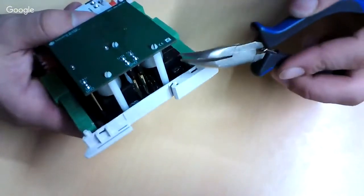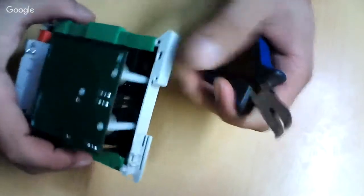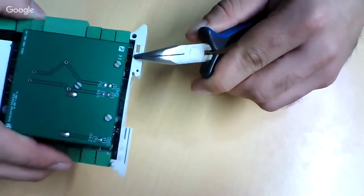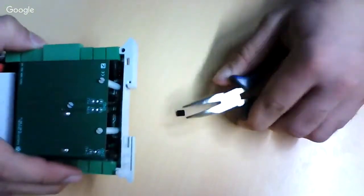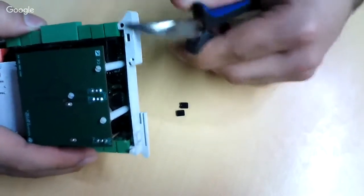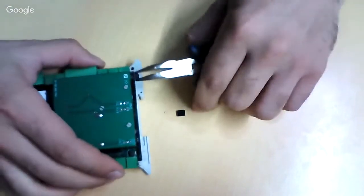The remaining jumpers are directly related to RS-232 and it is really important to have them configured correctly. The bottom part has a jumper that selects between hardware RS-232 or RS-485. Since we're configuring for RS-232, we need to place it to the positions closest to the external part — not the center — which correspond to hardware serial RS-232. I'll be connecting those now.